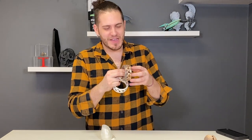I didn't have the PolySmooth machine — Polymaker, if you want me to look at that, send one over. The surface is very ripply, so unless you're looking for artistic-type jewelry where texture is okay, I would not consider this a professional-grade cast. There's just no way to get in and clean a lot of these details. The surface texture is almost integral — it's not a chemical reaction with the investment like you'd get with wax. What I put in is what I got out.